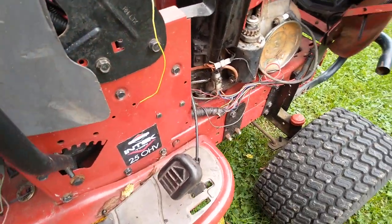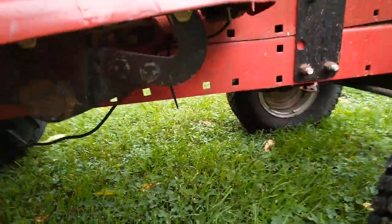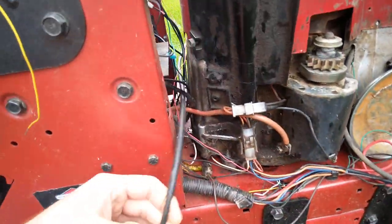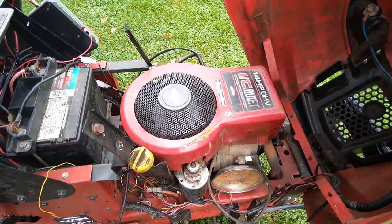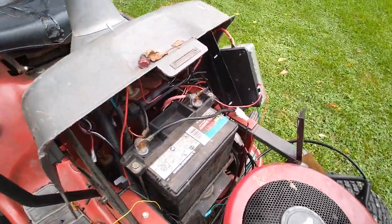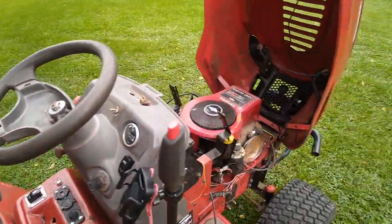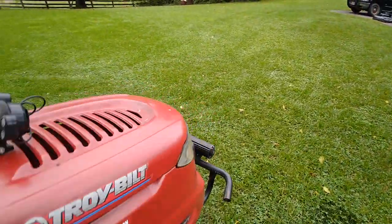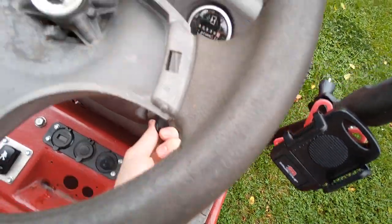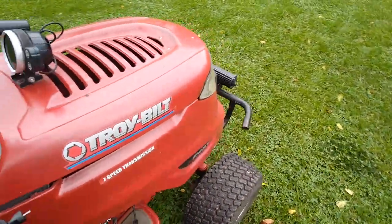The custom gas pedal is made from the GO pedal off of a hydro tractor. It runs underneath into some linkages and comes up through my throttle cable. The entire wiring harness has been redone by myself. Up top I have a tachometer that is key-actuated with a shift light, set to 5000 RPM.